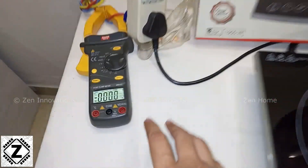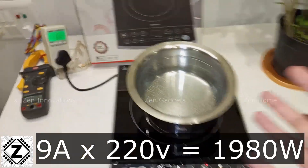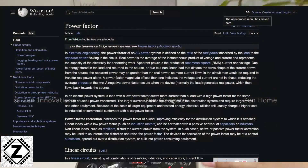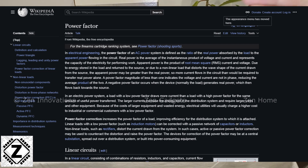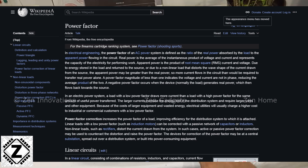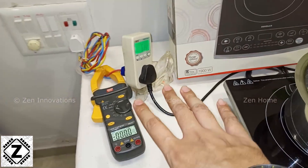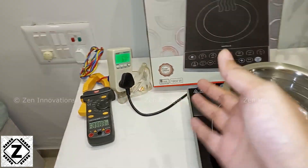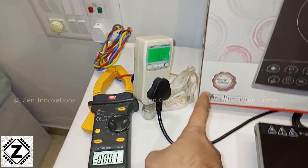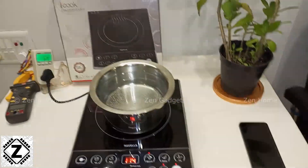You might be wondering: we saw 8.5 amps, but if you multiply it with the mains voltage, the numbers don't add up. There is a thing known as power factor, which is a very advanced concept — I'm not going to cover it in detail in this video, but I'll give you some links in the description below where you can understand power factor. The power factor of these machines is not perfect; hence when you multiply the amps by the mains voltage — which is around 220 volts here in India — the mathematics does not add up. This is why the ampere value and the watt meter value will be slightly different, but it still gives you a clear idea of what this thing consumes.